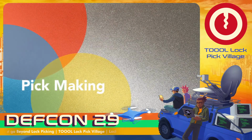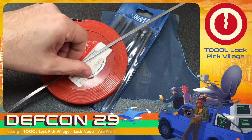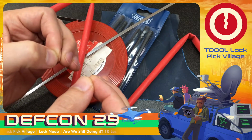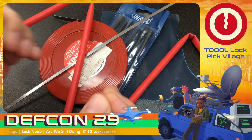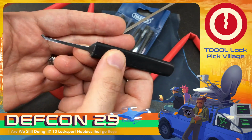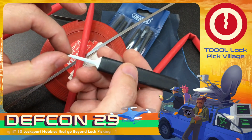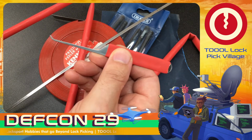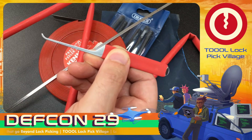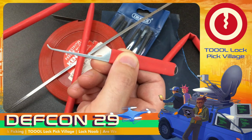If you have access to some sandpaper, some files, maybe some feeler gauge or wiper blade insert, and optionally some shrink tubing, you can start to do one of the most enjoyable side hobbies in Locksport, and that is of course lockpick making. They don't have to be pretty. This was the first lockpick I ever made by myself, just using some feeler gauge, some shrink tubing, files and sandpaper. Not only is lockpick making incredibly satisfying, but you can start to make tools for very specific purposes. For example, this super long nose pick for picking a super deep keyway.